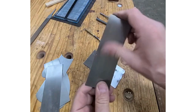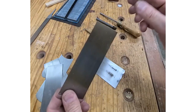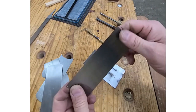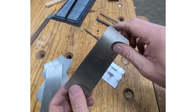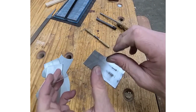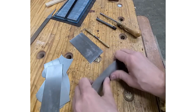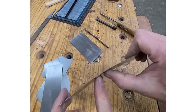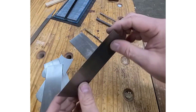These are made in France from hardened spring steel, hardened to 48 to 52 on the Rockwell scale, so much harder. They hold an edge exceptionally well, but they're a little trickier to prepare — I'll show you how I do it and get good results. They're 16 thousandths thick, so I can actually flex these and get into nice confined spaces if I need to. I like having a set of both the thicker ones and some thinner ones around.